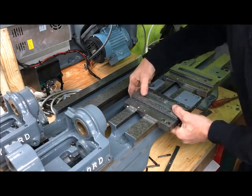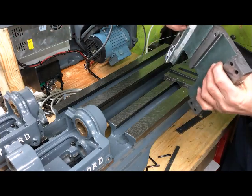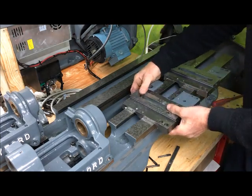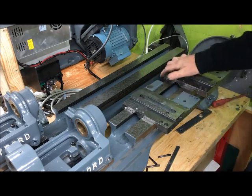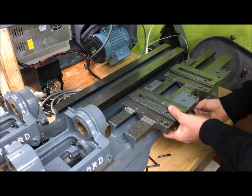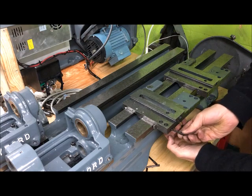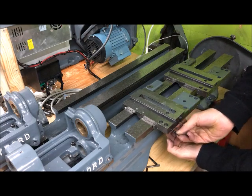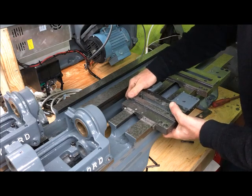This will also be my attempt to make it like a rear guide saddle, and we put that thickness of Rulon on, which, to my calculations, seems to make it. Then I have clamped it there temporarily by just inserting the gib again and then screwing this tight so I locked it down so we can clamp it like that. That was my take on it.